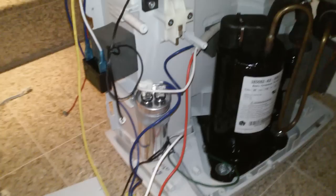If you look right here, this is the freeze sensor. To prevent the unit from freezing, this wire went to the circuit board. I simply unplugged this and ran the unit again. Same symptoms would occur.